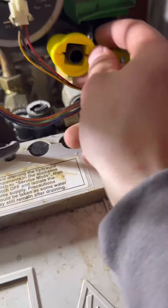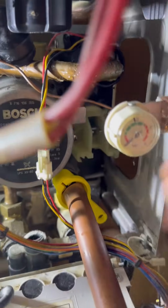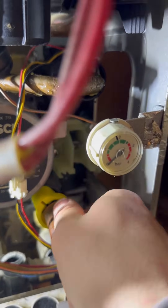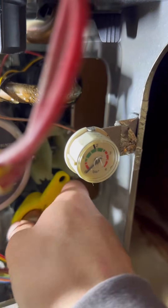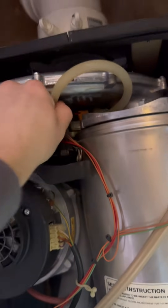Then I'm going to use my good friend Eddie to help drain down, so pop that on there. I'm going to pop the diverter valve motor out so that it drains everything out of the boiler, then open the drain off, then open the vent at the top of the heat exchanger.